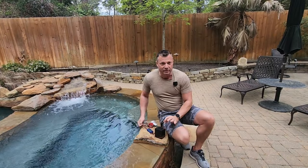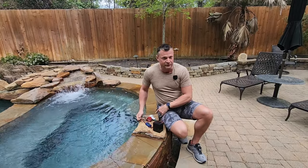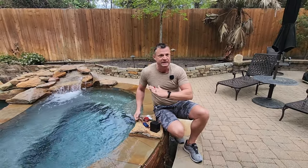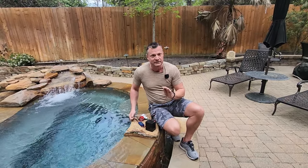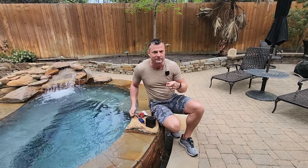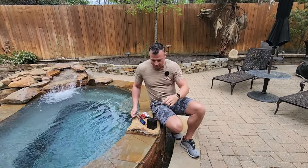There's going to be three tests that I'm going to run. One is pump running free in the air. Second one is pump in open water, just pumping water. And then the third one is with me blocking off the intake for the pump. Now, again, if this gentleman is correct, we should see the amperage go down when I block it, because he says the impeller just freewheels inside. We'll see. It seems counterintuitive to me, but we're going to see what happens.